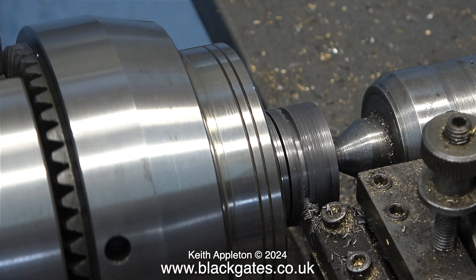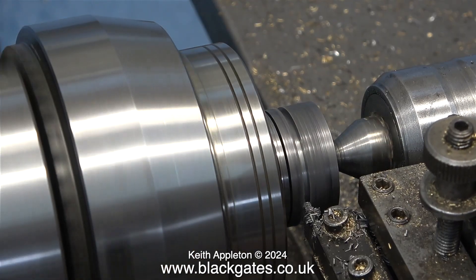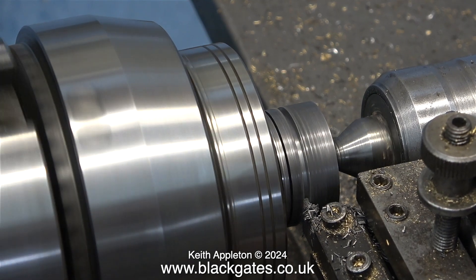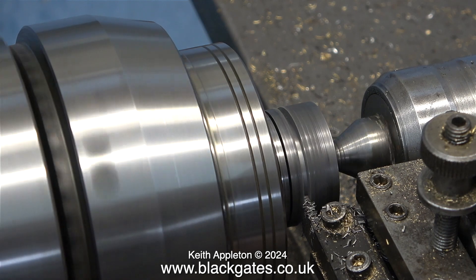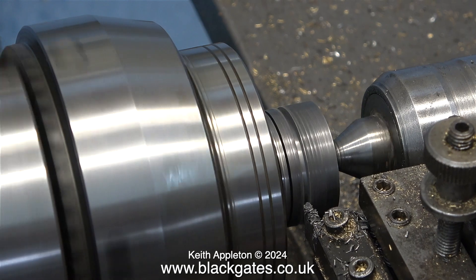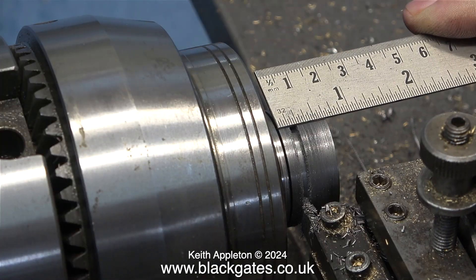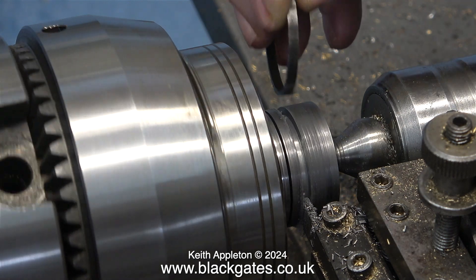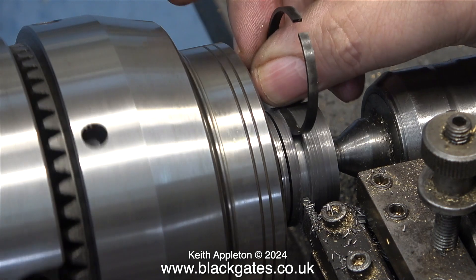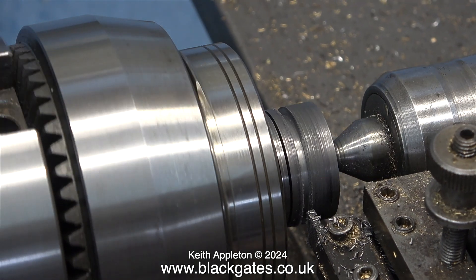Once I started the cut I had a third check with the ruler and it seemed about right. I need to machine grooves that are one eighth of an inch thick, or just slightly over, to accommodate the one eighth of an inch thick piston rings. The depth of the groove is relatively unimportant as long as it's less than the internal diameter of the piston ring itself. I'm using the actual piston ring as a gauge, and by widening the groove with the parting tool the piston ring becomes a perfect fit.